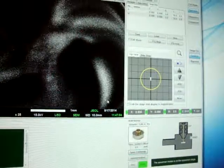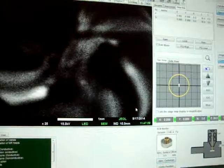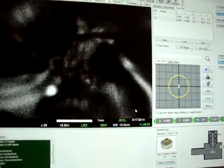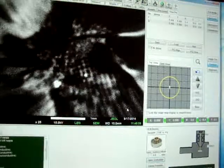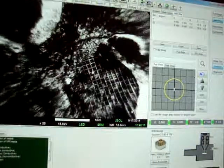You gotta remember, you're dealing with two things. One is your beam, objective lens, focal, and one is the Z height. When you do WD, you're setting the focal length. When you're setting Z, you're setting the Z height, the sample to the focal length. Okay, got it.